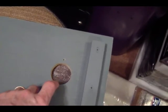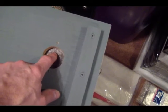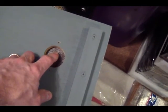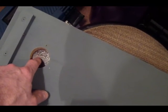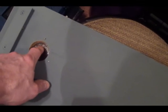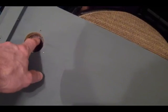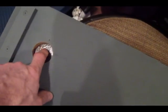and in here we're going to drill some holes. This has got a little tackiness to it, not much. That's where we put the adhesive on there, the laminate contact cement. That's what I'm trying to think of. The contact cement, because I just went ahead and covered the whole piece. I just wanted to make sure that it sealed up there good. And I didn't want to sit there and measure out and try to figure out where not to put it. So this stuff dries really good after a little while. It's got just a very slight tackiness to it, but doesn't hurt a thing. You'll never see this from the other side.